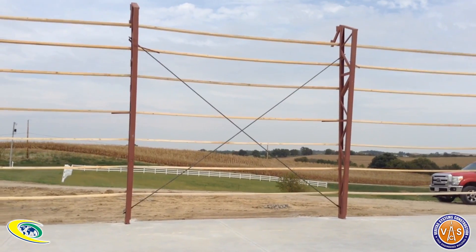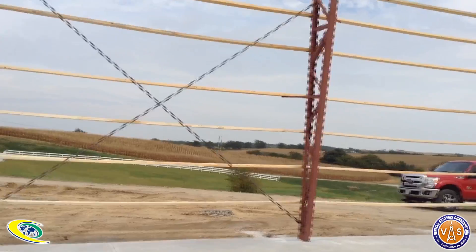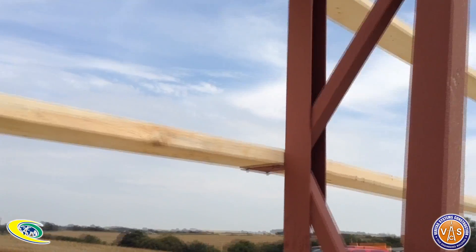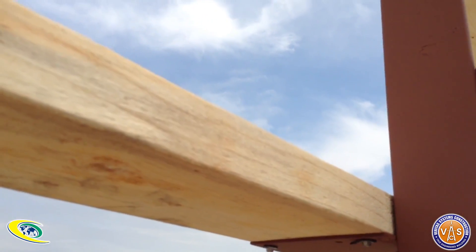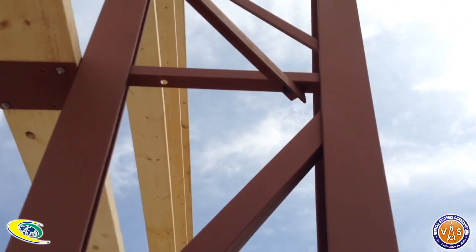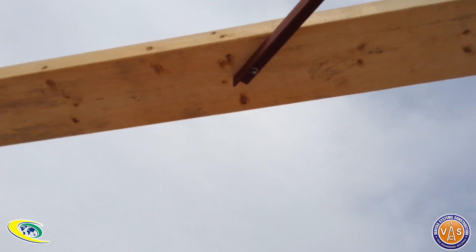Now that we get the legs up, they're all girded and braced. We'll do a little quick walkthrough on this here. If I come up to the side girts here along with the bottom cord brace, you can see that we got it in the center on the clip and we got the two screws on each clip.